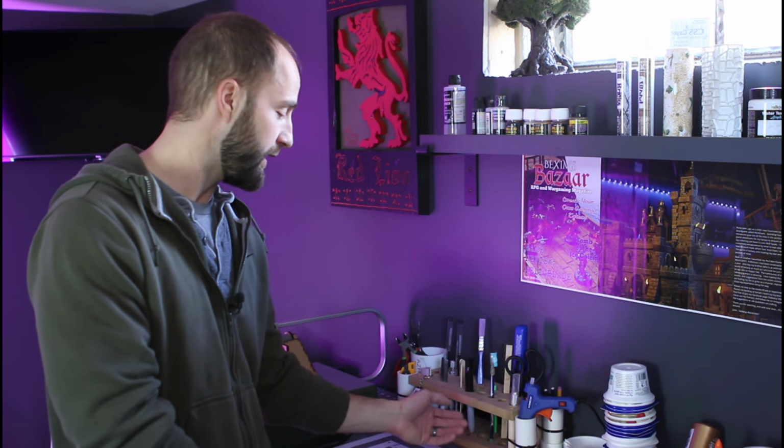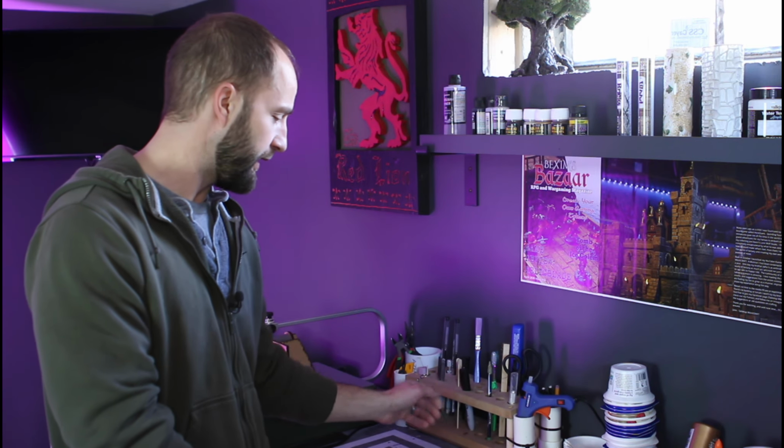So the jig that I made here, I have a little stencil for it. I'll put that also in the description below where you can go ahead and download that if you're interested. It'll just give you an idea of where to make all your different cuts if you want to go ahead and build this yourself. Essentially, you're going to take two pieces of wood or MDF board, sandwich them together, and make your cuts all the way through both. And then on the bottom of that, I put a small piece of wood or something like that to hold it in place. And all your tools here will fit real nice in that.